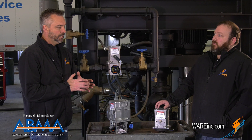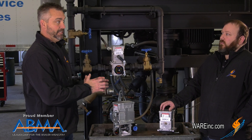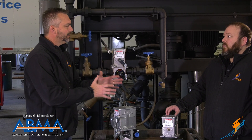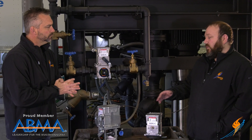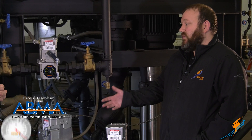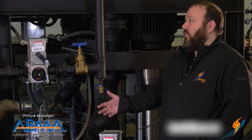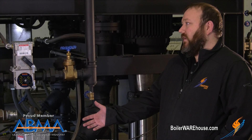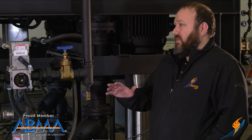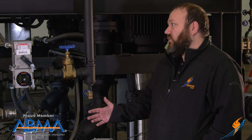Is there one particular way that this motor works — does it just come on and drive, or is there some programming in it? Honeywell does a really good job of being able to do almost anything with them. They've got some that are just purely on/off. They've got some that will modulate up and down based on a control signal — four to twenty milliamp, zero to ten volts, or zero to one-thirty-five ohm, which you see a lot in the boiler industry with your low water cutoffs. From proportional to stop, they've got a motor for almost every application.